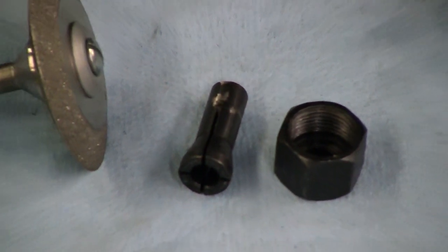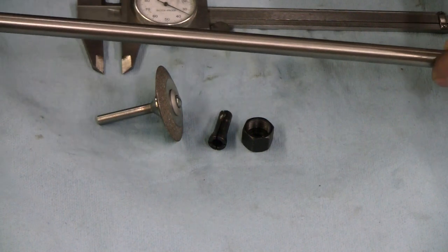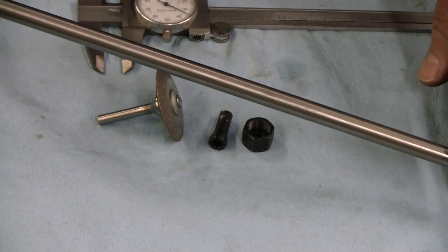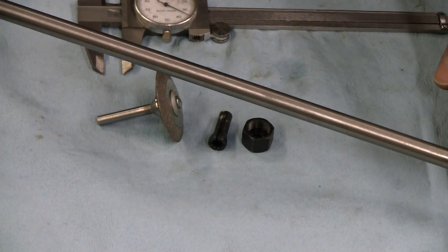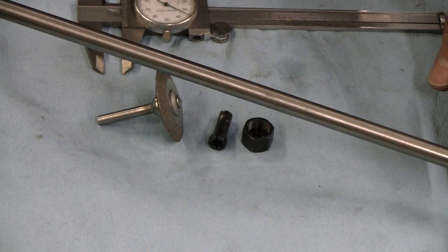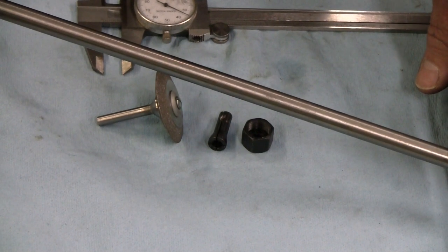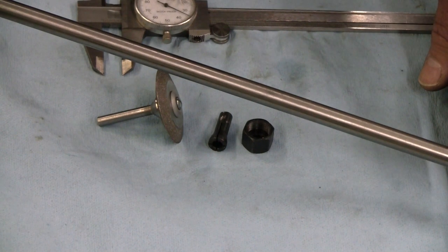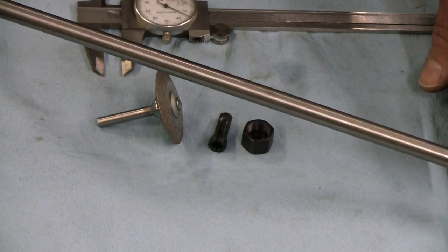I'm back to my oil hardening drill rod. This is 7/16ths O1 drill rod. Should work just fine. And we'll be doing all of the turning in one operation. I'm going to machine the outside features first, and then I'm going to drill and bore the ID. Then we'll part it off, take it to the milling machine, and do the slitting with the slitting saw. Let's go to the lathe and get set up there.